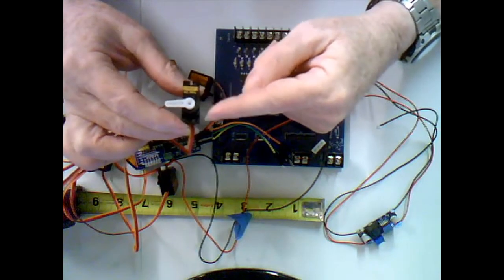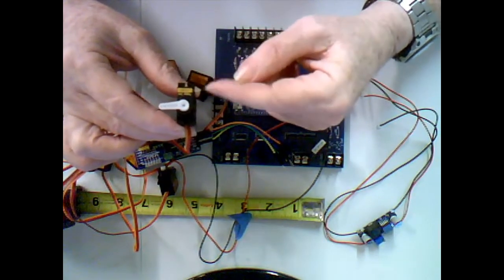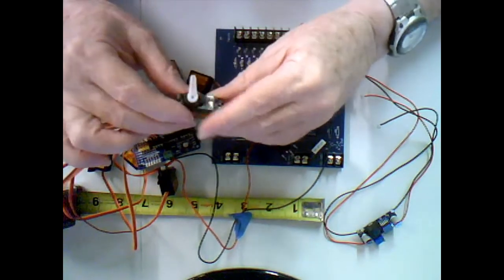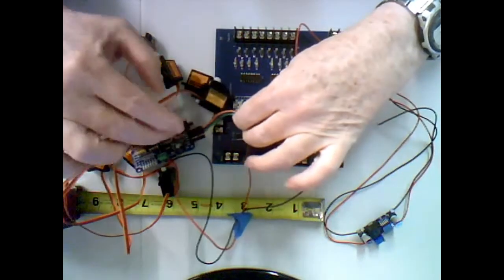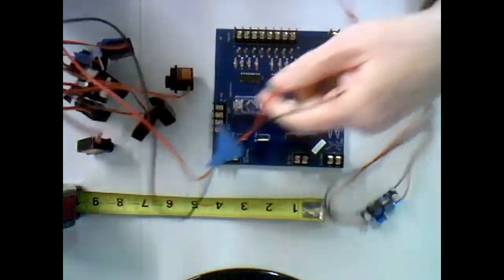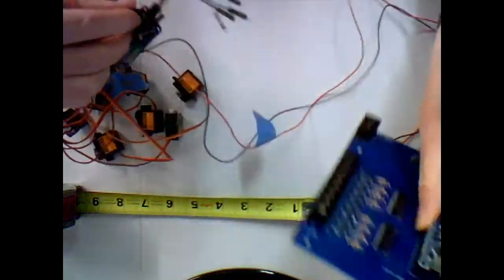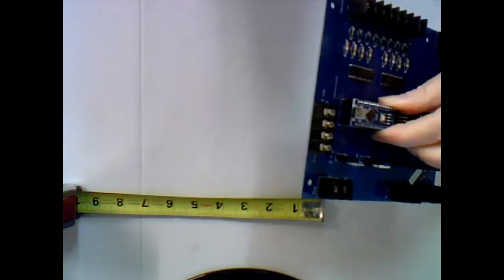So that's an advantage over the tortoise motor. The disadvantage is that I have no feedback with this. If I want feedback for this turnout, then I have to put an external circuit on it to control that. But all in all, it's a good combination. It's cheap. So I have 8 outputs on that input card as well. And I thought I'd better mention that to you.